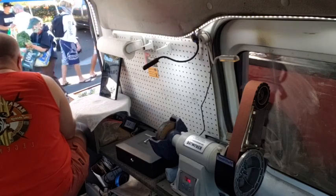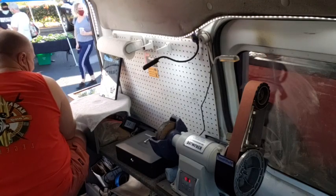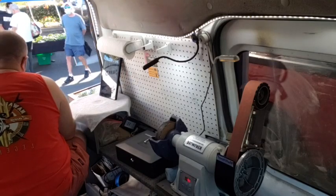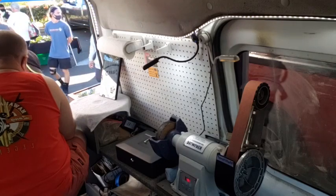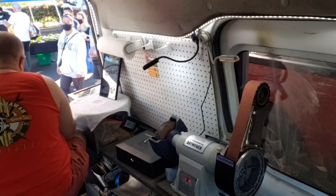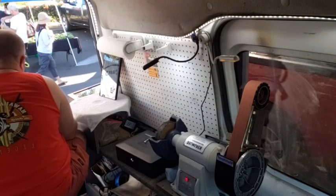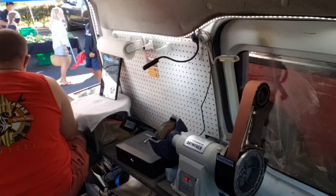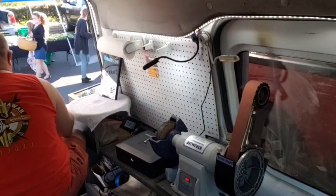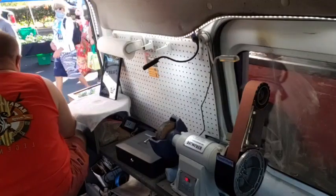The shinogi is the separation line, right? On a blade, this whole slope is the shinogi. So they tell you to follow the shinogi when you're sharpening. You put half of your fingertip on the blade and the other half on the stone, and you apply pressure. You're sharpening only on the push, and on the pull it's very light. That's the stone method. A lot of times people get their fingers shaved down because on the pull they get cut. Here's what I did.